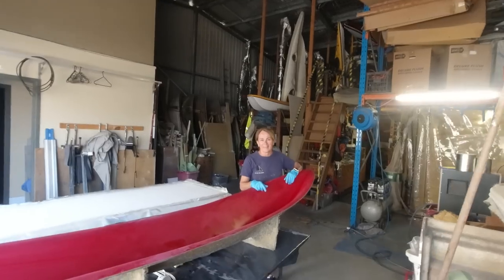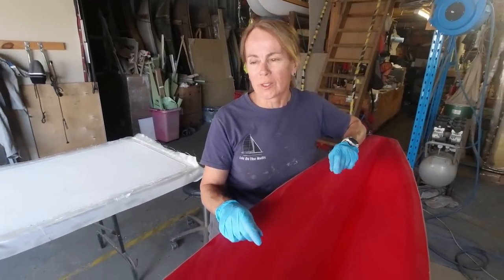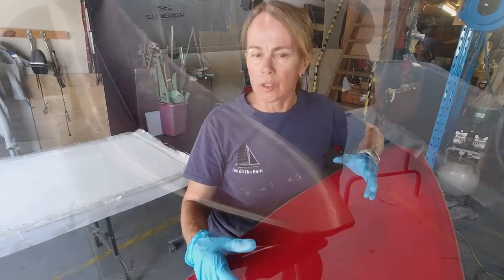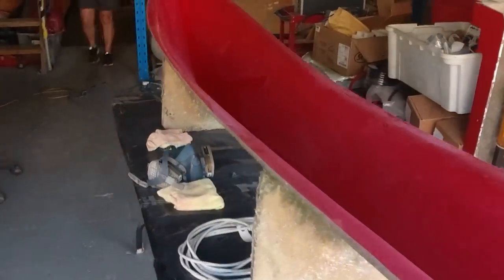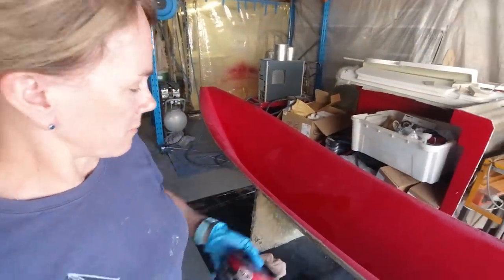This may look like a small canoe but it's actually called a nacelle mold. I'm polishing it up so we can make wave breakers that go under the hard deck at the front. What they do is act as a disperser of the wave so that waves don't slam on the bottom of the deck. Because we have a solid deck, we need that to break away the force of the wave so it's not too noisy. I'm going to put two underneath the deck, and I'm polishing it up with the supercut compound before laying that first layer.